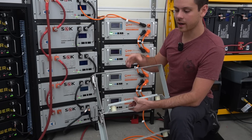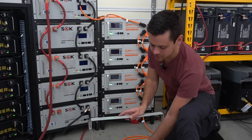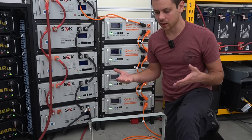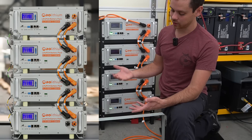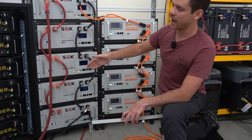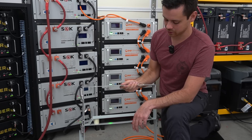The strength of this rack comes from the battery itself, so the battery on the bottom is being compressed by the batteries on top. I imagine that imposes a limit on tower size — all I saw on the website is a maximum tower height of four batteries, so that's probably all you can do. On server racks there's no compression on each battery and you can buy them very tall, so that's a huge limiting factor of this system.